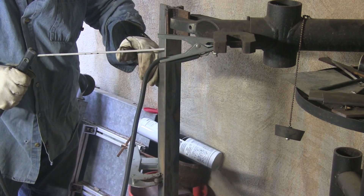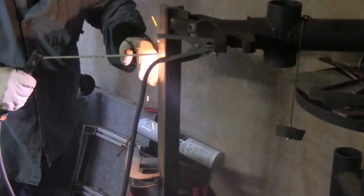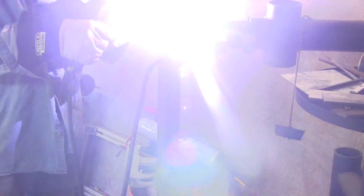I bumped it up to 125 amps. The amperage is something you've got to balance out — you've got to have it hot enough so that you can make good restarts and get good penetration, but not so hot that you have to fight the puddle and constantly worry about undercut, the puddle sagging and falling out. Also, the higher the amperage, in my experience, the more arc blow you'll tend to have toward the end of the welding rod, and that can be a problem.